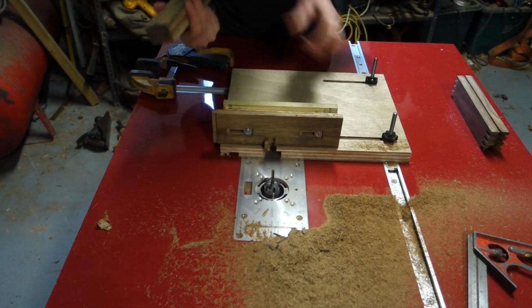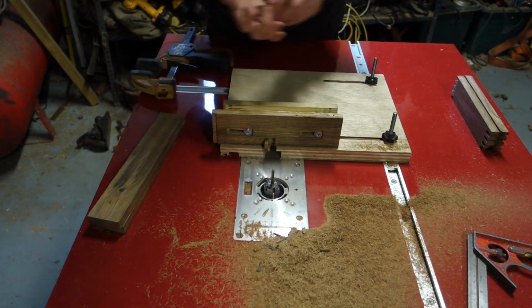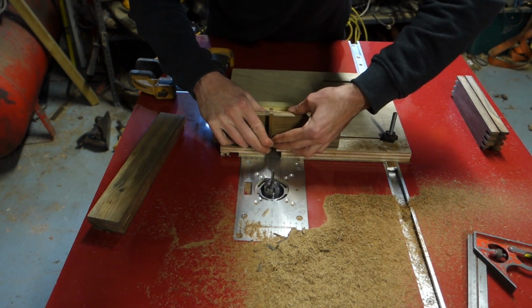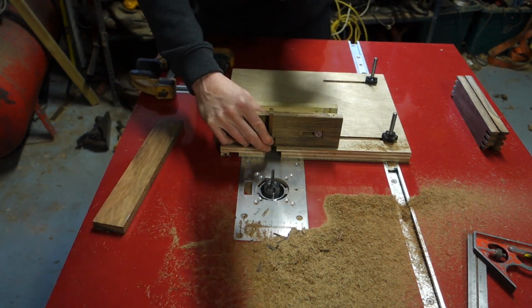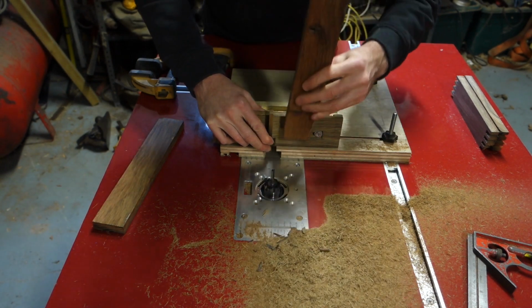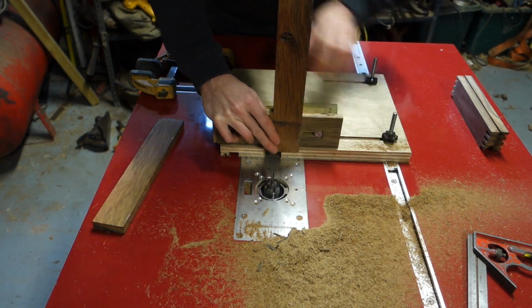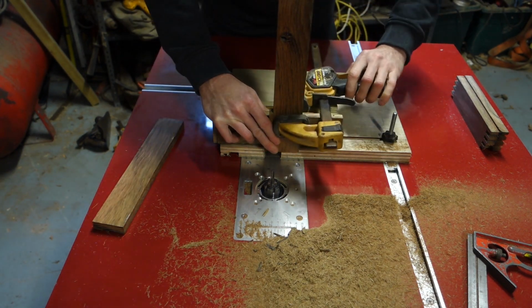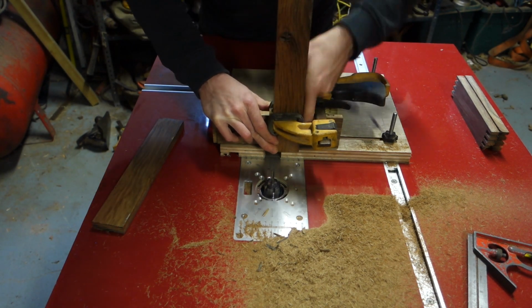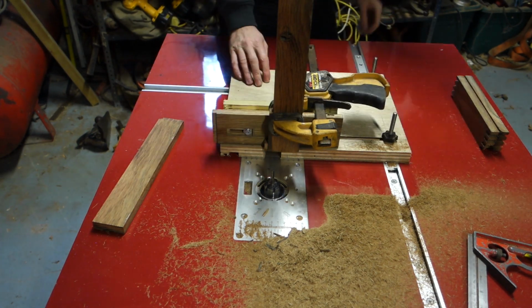Right, so on the other sides, what we do is we use a spacer and we space it one thickness of the cut, and then that's where we make our first cut. It's 1 thickness, and then that'll produce the tooth, or the comb or tenon or whatever it is. So let's get on with it.